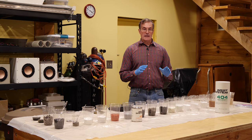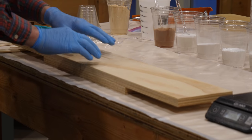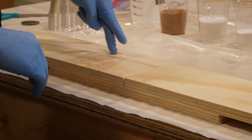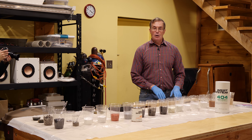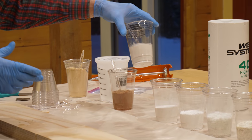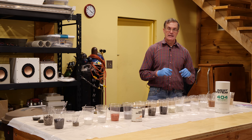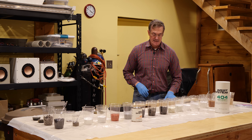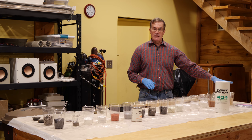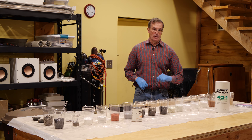The next thing you might want to do is take care of defects in surfaces. If we've got a joint between two boards with a crummy interface — damage from a hammer, scratches, holes, and dents — we want to create what's called a fairing compound, something that you can sand and will provide a nice smooth surface. For that application we use hollow glass microbeads or balls — micro balls — and phenolic microbeads. These materials, when added in approximately equal volume to the epoxy, create a nice sandable paste that has about the same toughness as the wood.